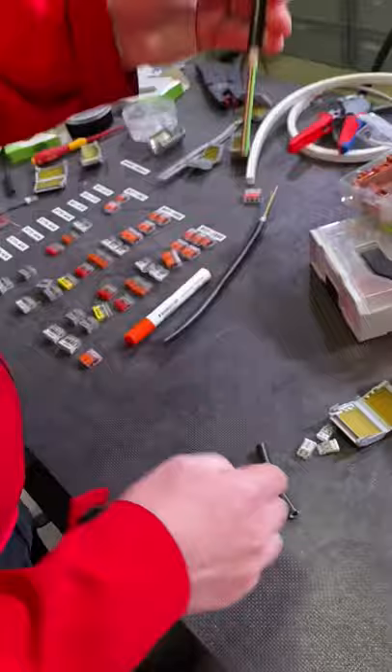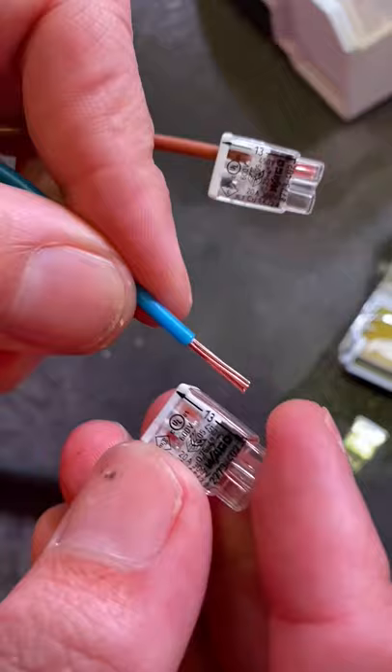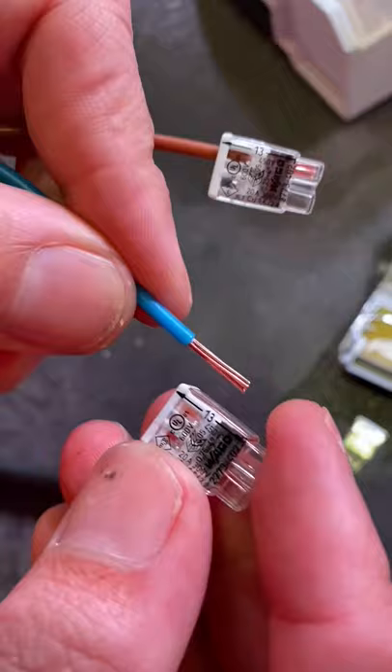There's a little nick in the cable there. You'll be telling me next you'll be able to strip the inner conductor insulation off. Strip the inner conductors here, match it to the right conductor size — 1.5mm squared. What's the insulation material around those conductors? XLPE, so that can be quite tough to strip.